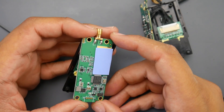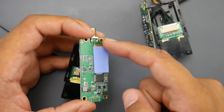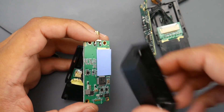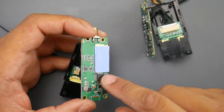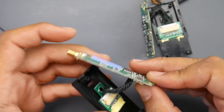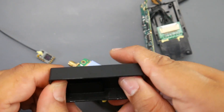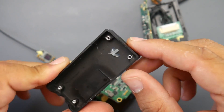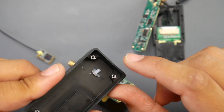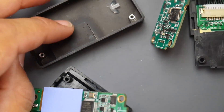On the Light Pro board, the SMA port is actually soldered into place, unlike the R9M Light, and it seems to be well thought through. The thermal adhesive sits over exposed copper from the board, and the fat heatsink should cool down the whole board. The back side is plastic while the front is thick aluminium — really nice quality here.